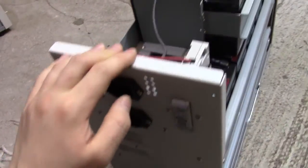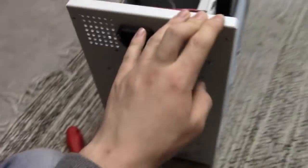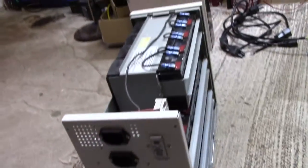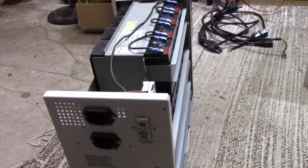And what's worse, these units' battery packs are just daisy-chained with a simple breaker. One battery pack comes in here, the other goes out there. So if you put two of these together and you are drawing less than 40 amps between them, they are just going to sit there and ruin each other.